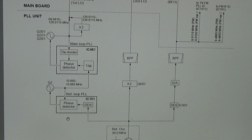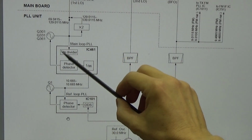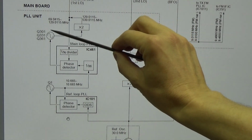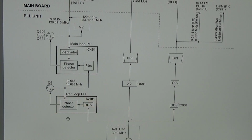And now you maybe understand a little bit more why it is called VCO, voltage controlled oscillator, and that is what the PLL is doing. So together with the loop filter, it is creating a nice voltage for the VCO to tune finally the frequency to exactly what we need. So that is what it is all about, and we can test it simply by seeing if the VCO is working. So that is the first thing we can check.